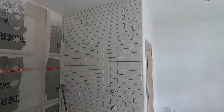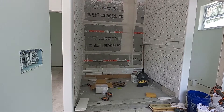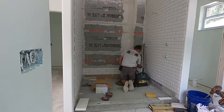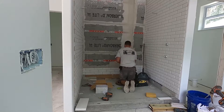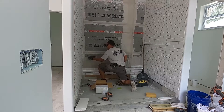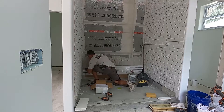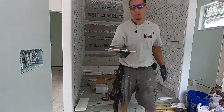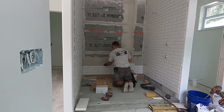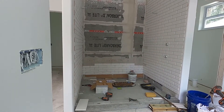This is the main shower I started with. I kind of did the side two walls but forgot to get the footage for that. Basically it's the same concept as the bathtub surround — I start off with the ledger board. For this one I started several rows up because we still had to do the curb, so I left the two bottom rows out to get the curb in, and then I could set the tile. You'll see later in the video how I take care of that.